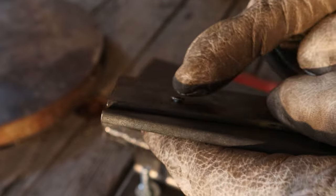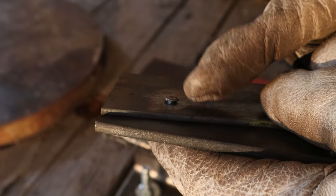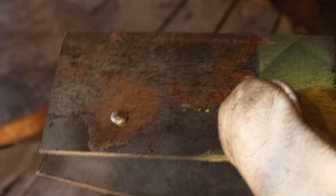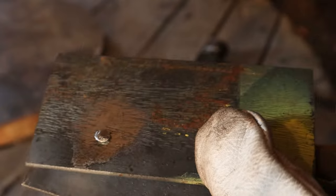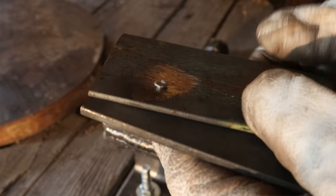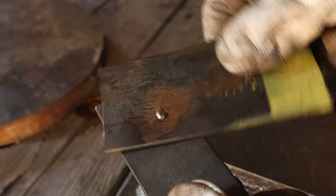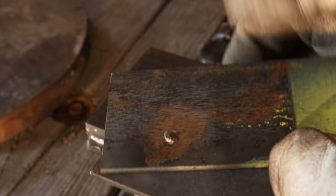I was cutting the roofing nail so it was about a sixteenth to an eighth of an inch higher than the top of the steel. I thought this was going to be way harder — like I was going to need to heat up the roofing nail and then hit it with a hammer. No, it takes like 30 seconds, hit it a couple of times, and you have yourself a pretty good little rivet. It doesn't have a lot of slop, and if there's still too much slop, you can just keep on hammering it until it's tight enough.